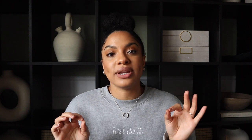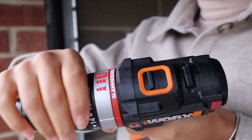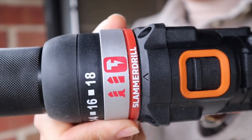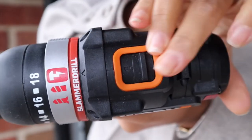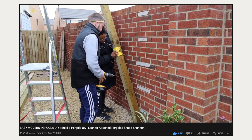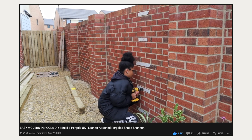If you're drilling into concrete, load-bearing lintels, or anything that is solid concrete or brick, you will need a hammer drill. This is a very important investment — trust me from personal experience. Investing in the right tools will save you time, energy, and money on blunted drill bits. When we were building a pergola and drilling into the brick, we tried to use a normal drill and it just didn't work. I wish we'd had the hammer drill back then.